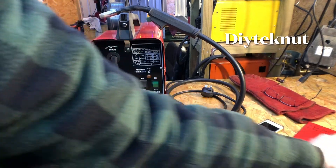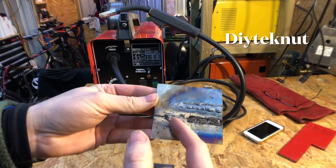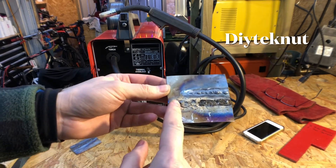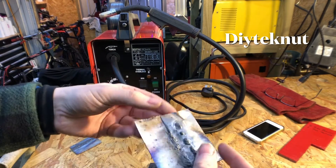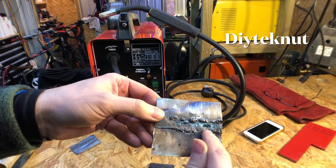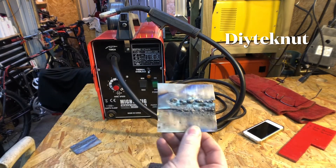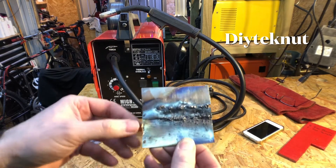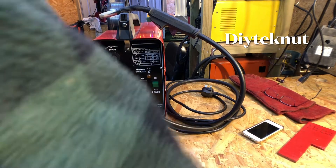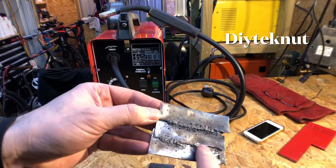Let's take a look at the welds on the thin steel. These were the first welds I did and you can see I burnt through all the way - this was on wire speed 1 and minimum power setting. The second bead along here is not too bad. Obviously if you were going to do this on a car bodywork panel you wouldn't weld the bead in one go - you'd weld a centimetre at a time and go to different spots so you don't warp the panel, but chances are you're going to blow through.